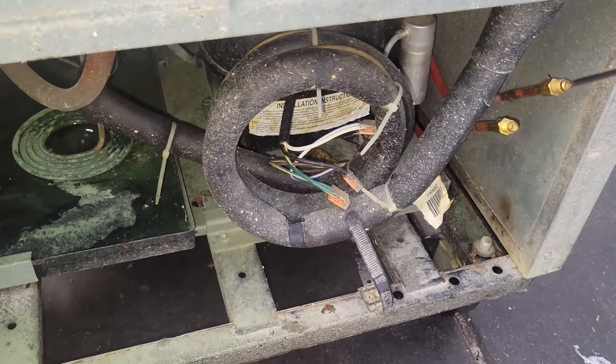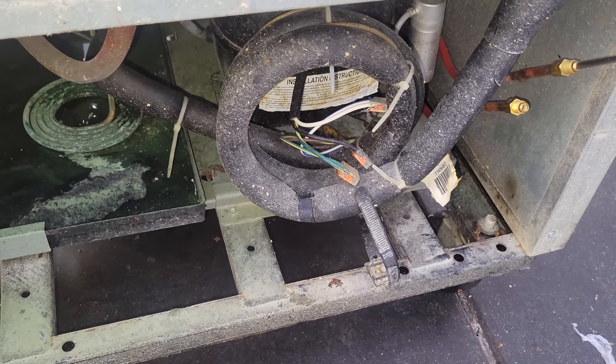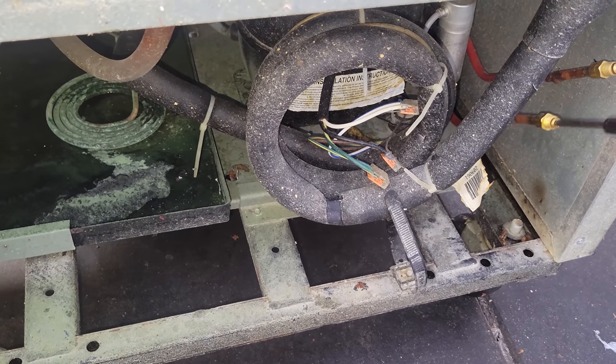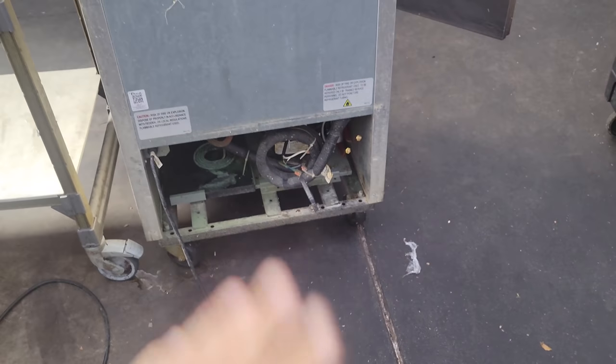We're in a well-ventilated area, so there's no need to even put my service gauges on this guy. We're just going to crack the charge. We're outside. We'll let it vent out. Again, this is R290 unodorized propane, so you got to be very careful. But we'll let that vent.